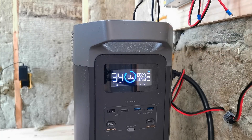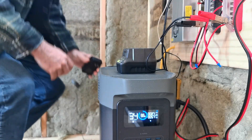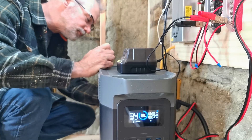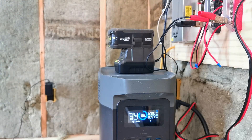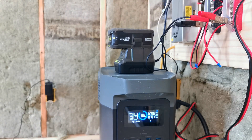It doesn't sound like a lot, but it all adds up in a small solar system. But now that I'm at 30 watts, I can turn on the lights again. You can see I've jumped to 58. The other thing I find myself doing while building this cabin is charging batteries, so I'm going to turn on my AC, get my battery charger, and start charging the battery. You can see what that does to the power consumption - we're using about 100 watts now. That's running all the lights, running the diesel heater, and charging the battery.